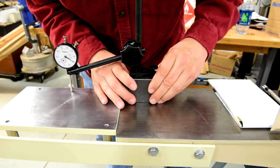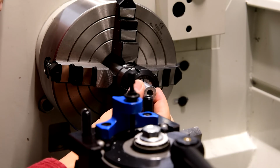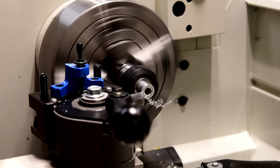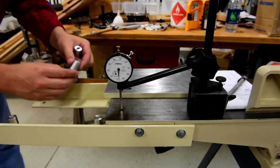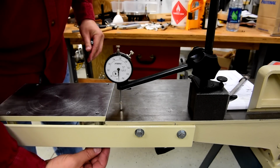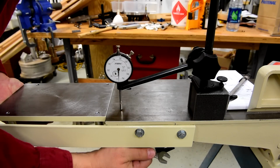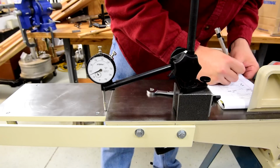Having my measurements, I can now shave off some of the spacer height. I will leave a little extra until I get the final measurements. I'm using the lathe to take off the excess material, but a file or grinder will work too. Everything is assembled again for another measurement. This time the bolts will be tightened all the way. Then all measurements taken again, and the spacer height reduced some more on the table.